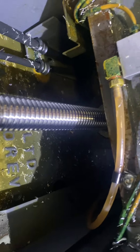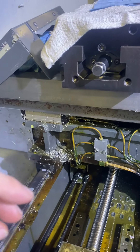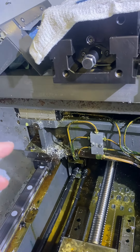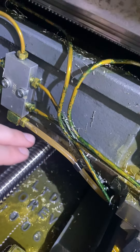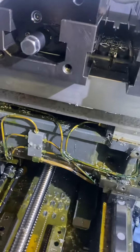I may pull the one off of the y-axis while I'm in here, but I did see oil dripping from that, so it's safe to assume we're good. It's not like a hard-packed paraffin like the purple grease did. What's really important to note, though, is if you have any soft line — whether it's the quarter-inch main feed or an eighth-inch going to the ball screw — you have to be super careful not to blow that out.